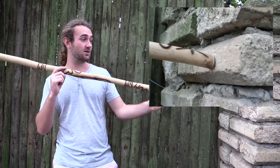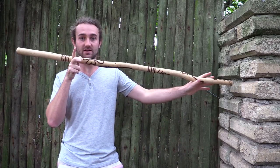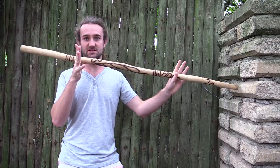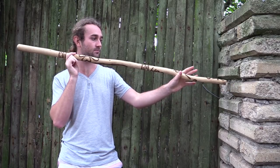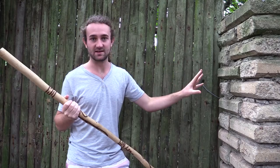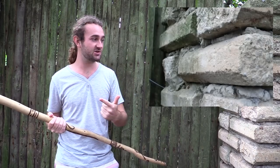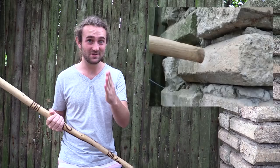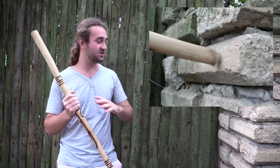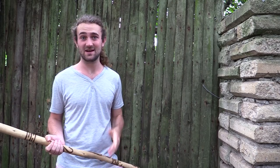There is such an easy way to eradicate this problem. For the second test, we're going to hit that wall again, but just before the hammer reaches the valve pin, I'm going to let go of it — in other words, the hit happens because of the inertia or momentum of the hammer itself and not because of spring tension. You see that there's a hit and there are no successive impacts. It's such a simple way of doing things. The Daystate slingshot hammer is doing it, the FX hammer is doing it. It quietens the gun — there's actually no reason not to do this.